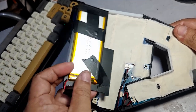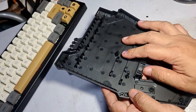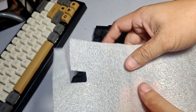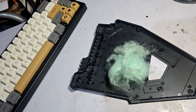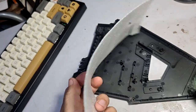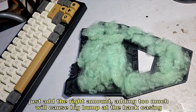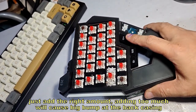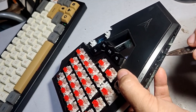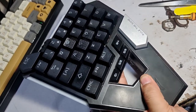This is three layers of masking tape — this is called the tape mod. Put the battery back in. Next, for the back casing, we will fill it up with fillers — foam, polyfill, or PE foam — cut to size. The reason for this is to remove the hollow sound. Once the polyfill is in, cover it and tape the edges to hide it. Now let's do a sound test after the tape mod and polyfill mod.